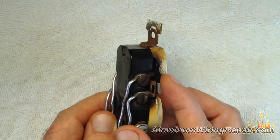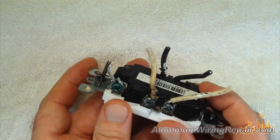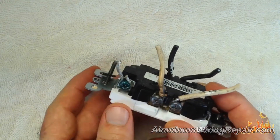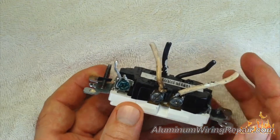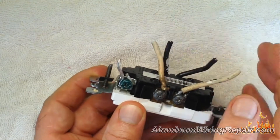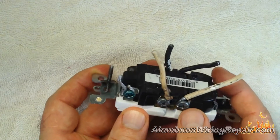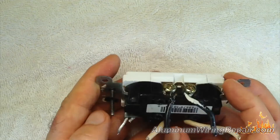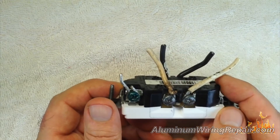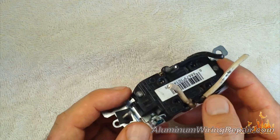Here's another one well on its way — you can see bubbling happening. We see different reactions, different ways these things appear to be burning. These are caused by loose connections. You can tell there's some bad burning going on here, and it was melting on the other side. This one and that one don't show any evidence of melting or charring, though this one might have a little bit of heat build-up — you can see just a little bit of brown along the ridge of the insulation.